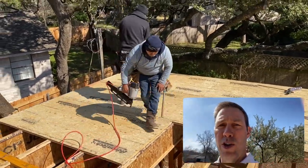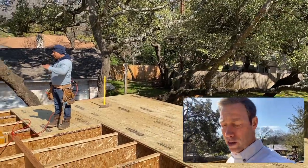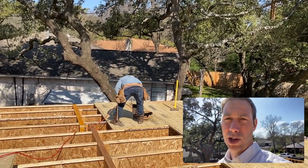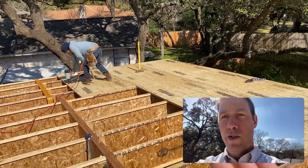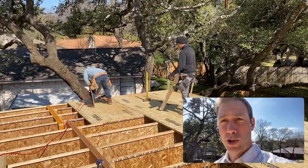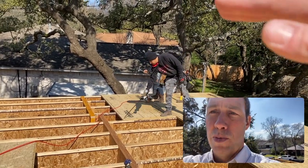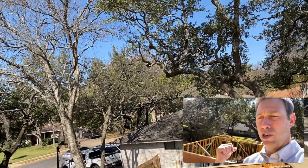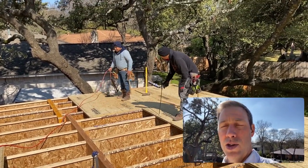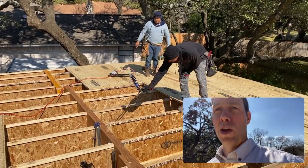All right guys, that's a quick video today on subfloors. Hopefully you learned something. Post a comment if you've been using this inch-and-an-eighth and you've liked it, or if you haven't, post a comment about what kind of floor system you like — I'm curious. It's interesting how different parts of the country have different floor systems that work for them. You'll also notice in a lot of my videos I also use open-web two-by-four trusses a lot, and those are a great system — a little bit more expensive but a lot more open. In this case I don't have a lot of ductwork in this floor system; I've got duct in an attic going up above and an attic behind me. So here I really only have can lights and one mini-split ceiling cassette that's going to get sunk up into this kitchen ceiling. So we actually saved a little bit of money using I-joists.